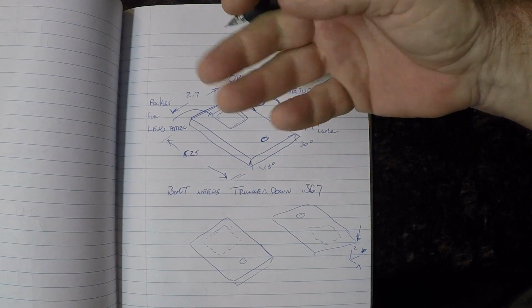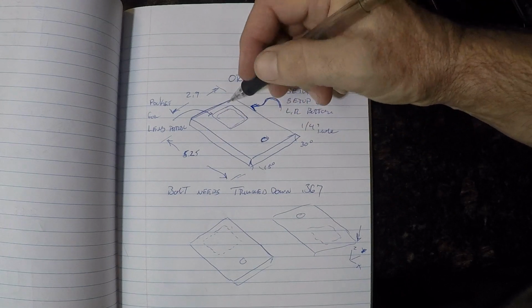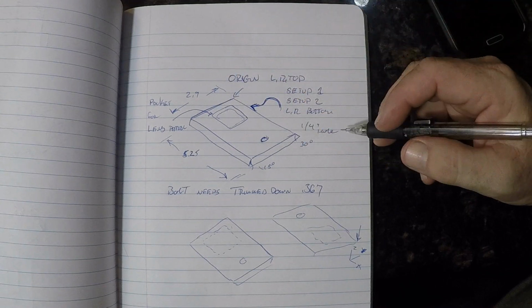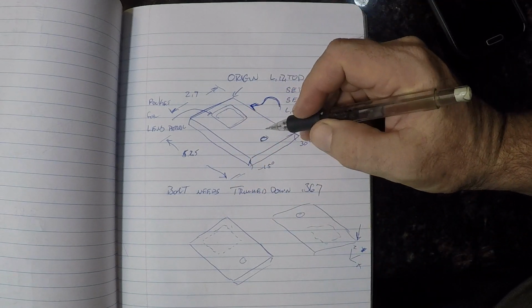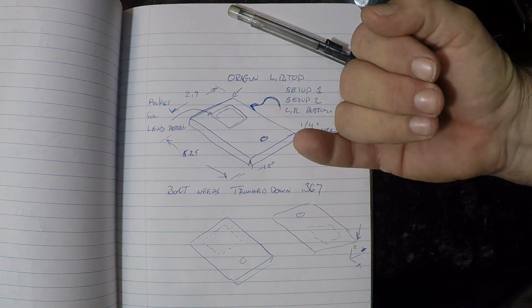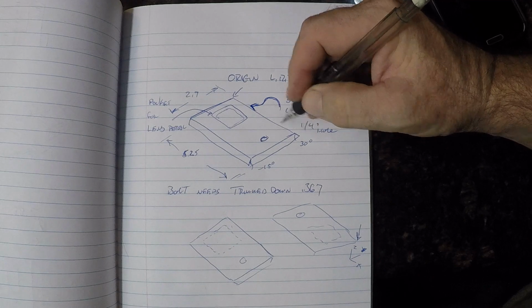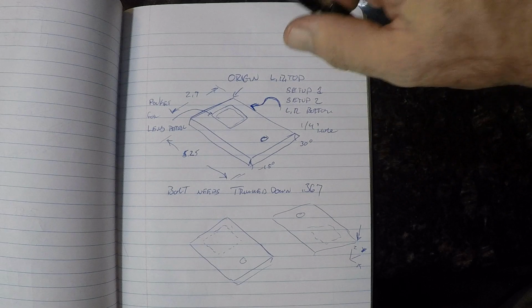I think it only needs to be maybe 20 or 30 thousandths deep, but I'm going to make it 150 thousandths deep. Why not? And it's going to be a big chamfer around the edge of it. I'll drill a hole in this side. Okay. Then we'll flip it over. I'll counterbore the hole. That means put a wider cylindrical hole on the other side of the thing to make room for the socket head cap screw I'm going to use to hold it down. Okay, and then on the side that fits in the dovetail, a 30-degree angle, and the side that addresses the screws is going to be a 15-degree angle.